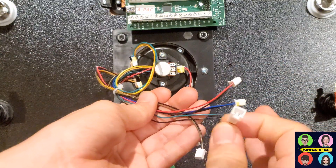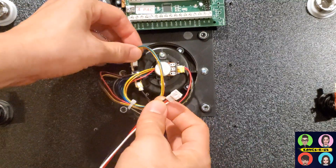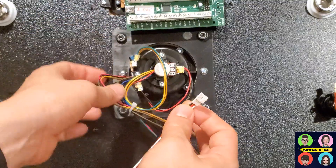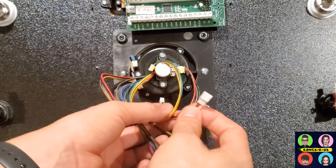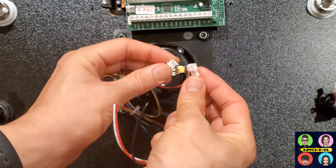You're going to need four of the two-pin connectors for the buttons on your yoke — the triggers and the top buttons. The three-pin connectors are for your two potentiometers for the X-axis and Y-axis. As you unplug these from the circuit board, you're not going to use the circuit board at all. This is the three-pin connector.